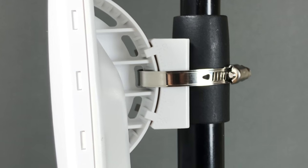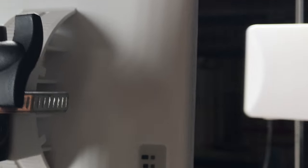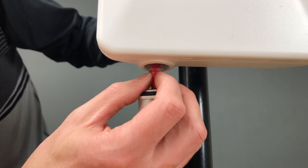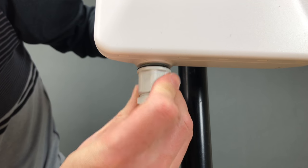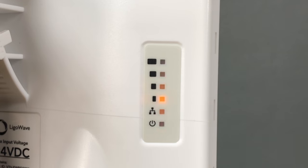The antenna is made from hard plastic with an IP66 weather rating. On the back of the device there are grooves to adjust its tilt when installed onto a mounting bracket — the holes define the antenna's alignment pitch and the grooves help fine-tune this alignment. The only opening on the device is on the bottom where you insert the RJ45 network connection through the grommet. It's a gigabit interface, and lastly there's a set of LED lights representing power, network connectivity, and signal strength, with a nice flash sequence on boot up.